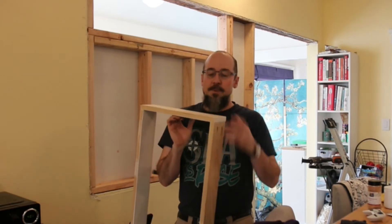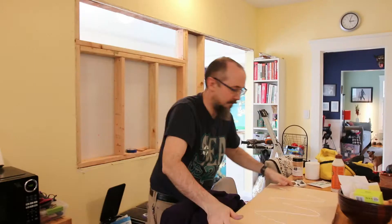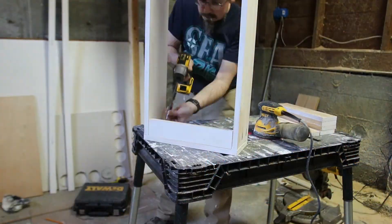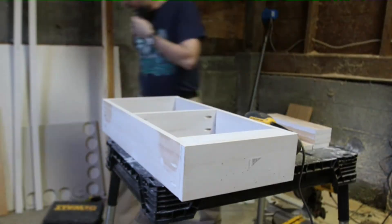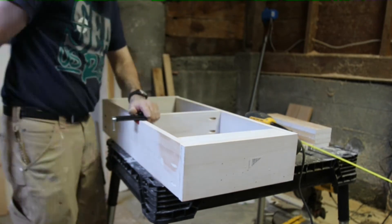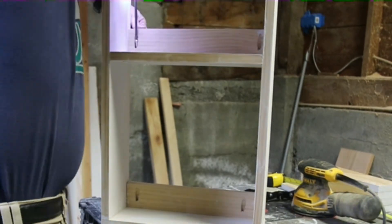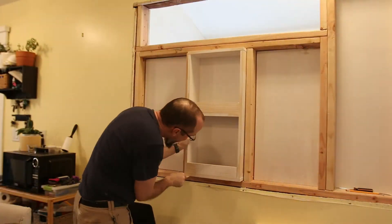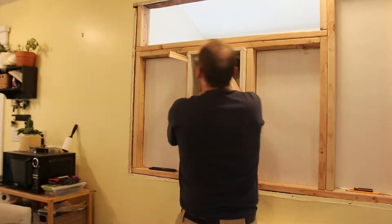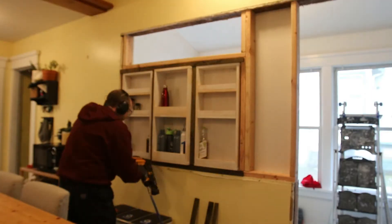So rather than rebuild these frames with deeper wood, I'm just going to use a leftover piece of plywood and stuff it right in there. I thought about making the shelves adjustable, but without a cabinet door I worried about things falling out, so I secured the shelves with pocket joints and created a low barrier just to make sure that things stay in. Then I nailed the three units into the wall, followed by some scrap plywood to make sure that when I attach the molding it will overlap the drywall.